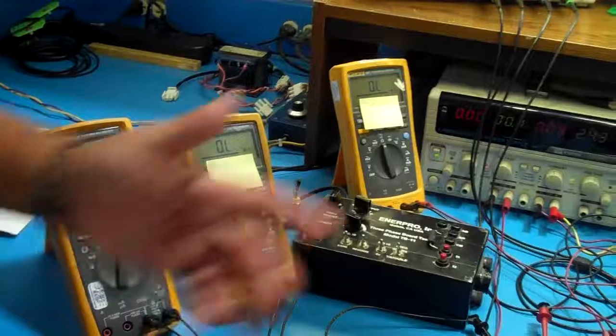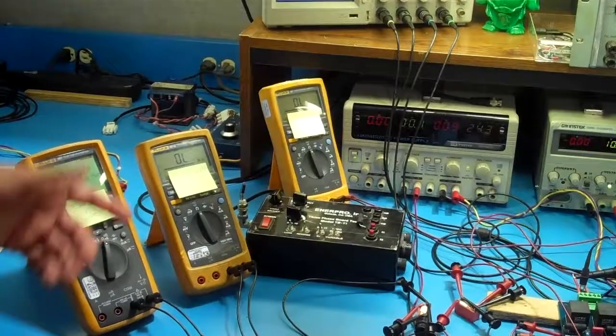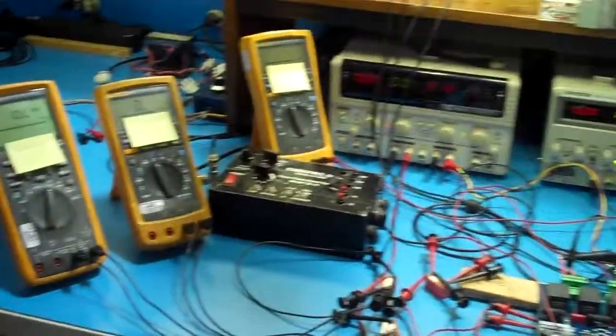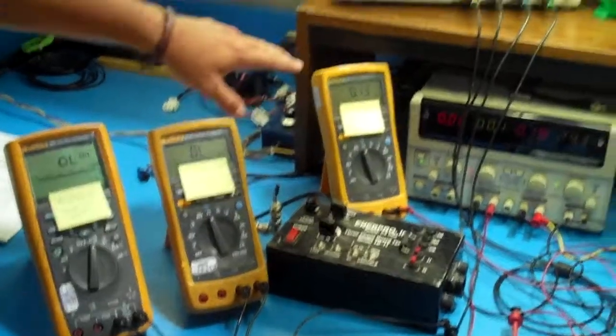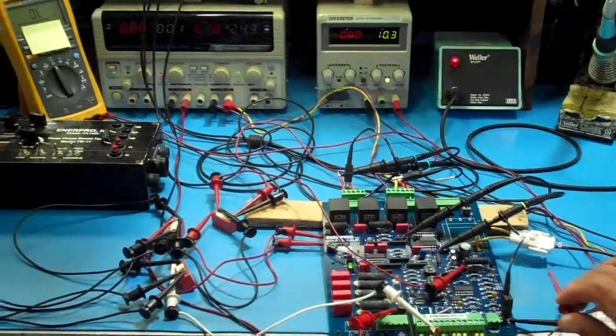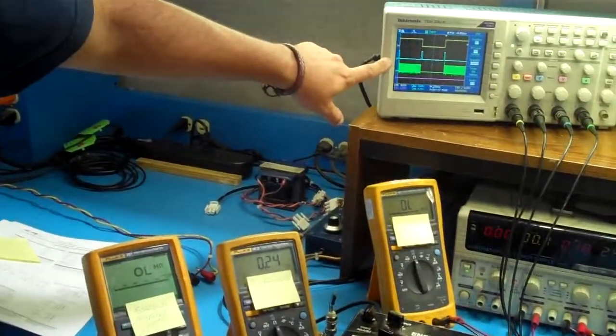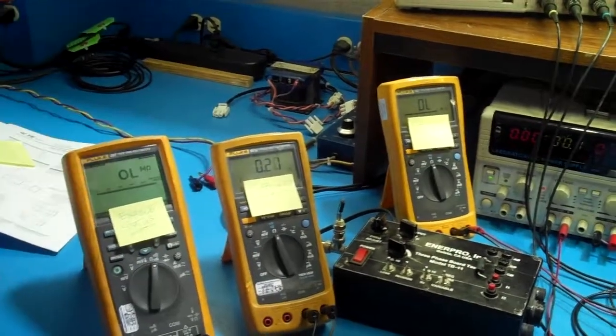And now that you inhibit it, right, Tony? Mm-hmm. You have the two relays open. So again, open it up, Tony, enable it. You are in the reverse, and go ahead, Tony, and do something that we're not going to be able to do, but you can go ahead and change the polarity without inhibiting. And now we notice the polarity changed, and now it went from the reverse to the forward while it's enabled.